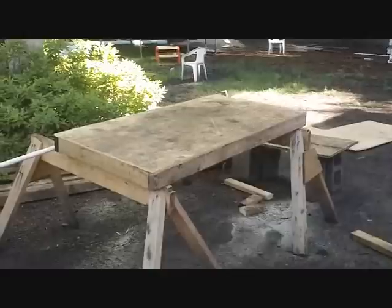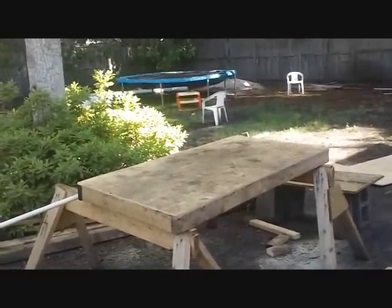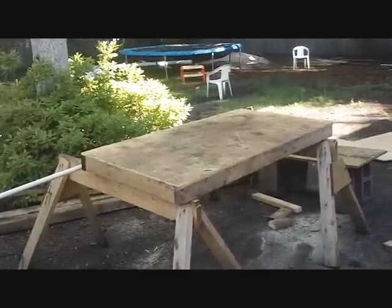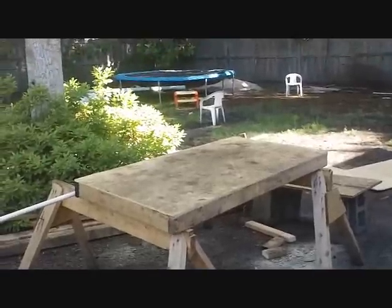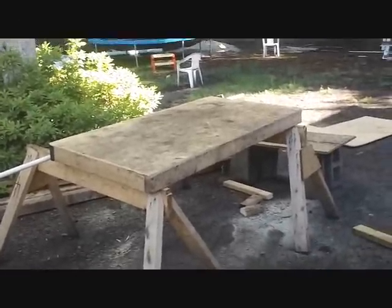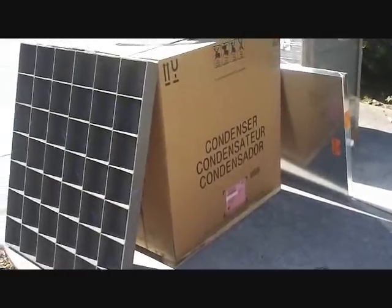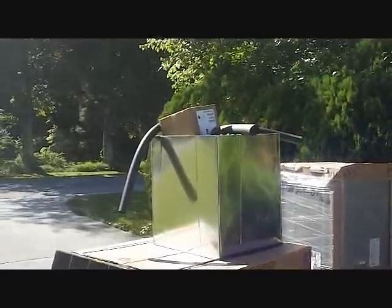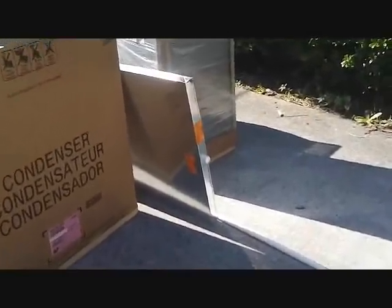Here's the platform I built — it's 32 inches by 60 inches to hold the drain pan and the air handler. I want to boost it up a little bit, so we'll have foam blocks underneath the air handler giving it about four more inches. That way we know our drain is going to fall real well, and our secondary drain will have plenty of fall too even though it's not as critical. Michael should be here in about half an hour and I'm about to go pump the old system down. Our two and a half ton 15 SEER unit is here — the air handler, a little plastic pad, a drain pan, and a piece of PVC — and we'll make that work and start installing.